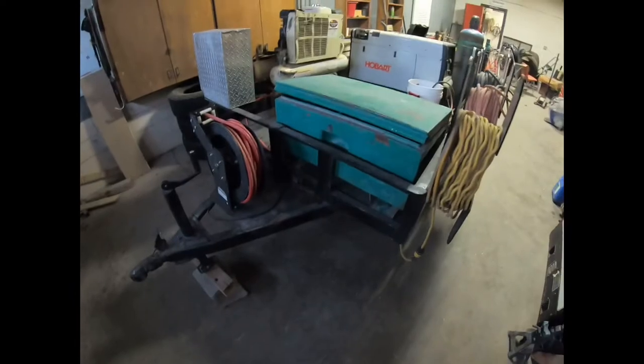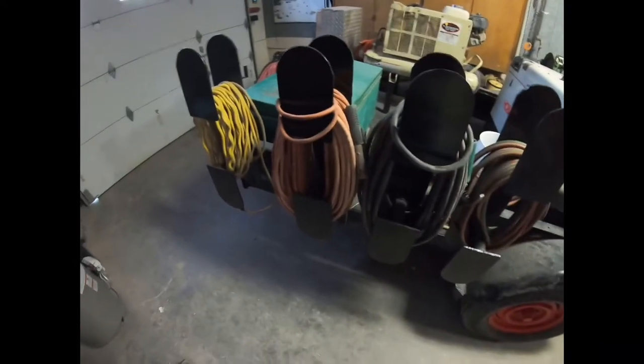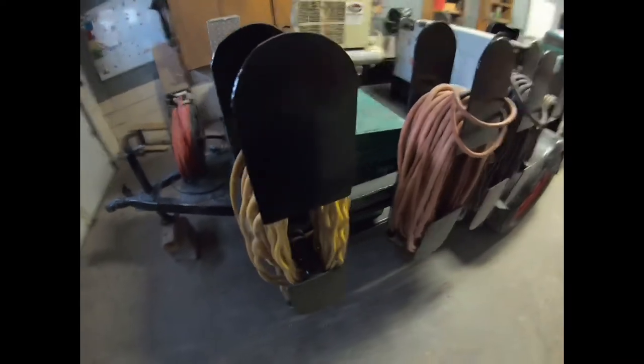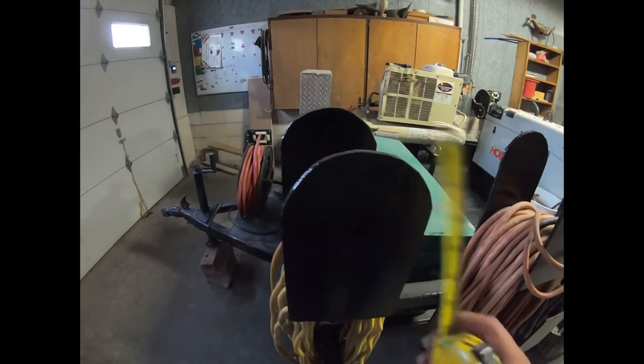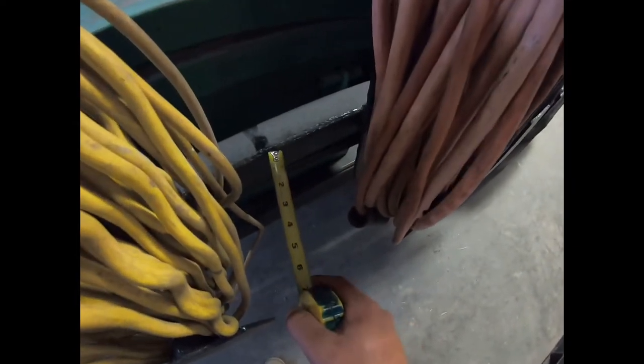Up here we put all the leads and extension cord — just got a hundred foot of everything. These holders I built out of two-inch pipe. They're spaced ten inches from each other so when you wind it up you don't have to go around a whole lot. That plate is six inches and I used a six-inch grinding disc to make these radius cuts — just traced it and cut them out. The plates on the back are solid all the way through, and I went ahead and welded it to catch these main angle irons that come up from the trailer.